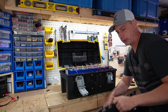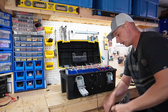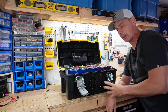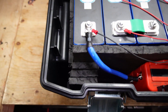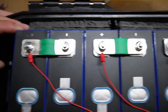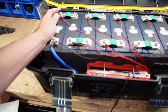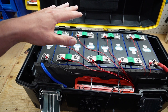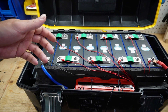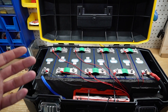Picking up where I left off — all this is, is just regular floor tile that you would use in your basement or workout area. I'm going to use that to fill in around the battery. I've got all the foam wedged in — on the sides, on the back side, and inside the front — which is perfect because this battery will not move from side to side or front to back. The only thing to be concerned about is it coming up if the toolbox were ever rolled onto its lid, so I just need to make sure I never roll it over onto its top side.